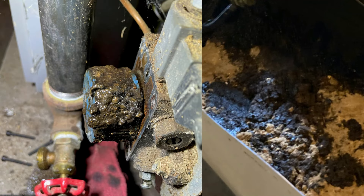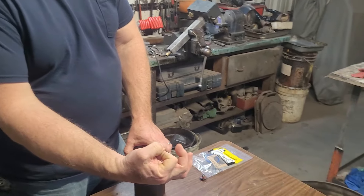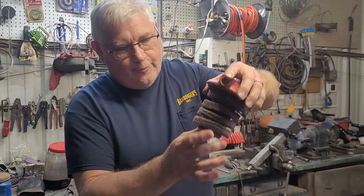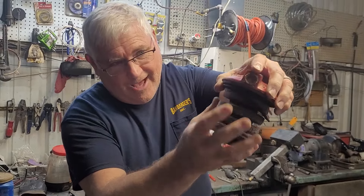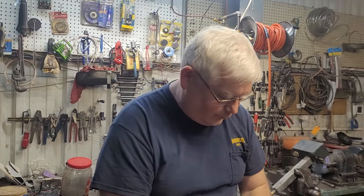Now let me show you other reasons why. You're going to drain all that garbage down to one little valve in the bottom of the tank that has about an eighth to a quarter inch hole in it, and you're going to try to get that tar-like substance through there. It's not going to work well for you. As soon as it leaves that, it goes through this filter, which is made to let oil soak through — but it can't soak through if it's dipped in road tar. That's reason number two.